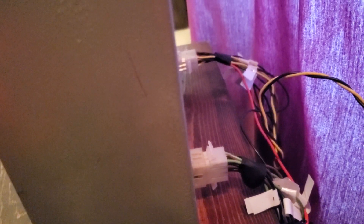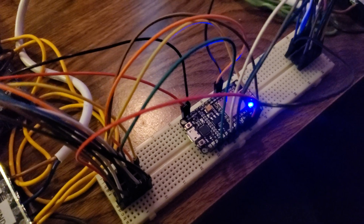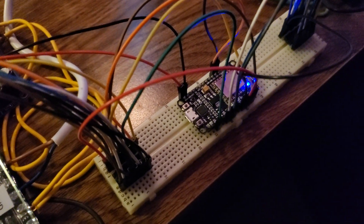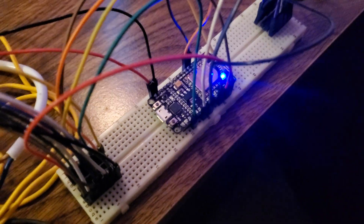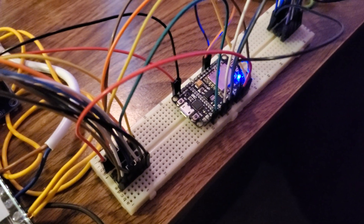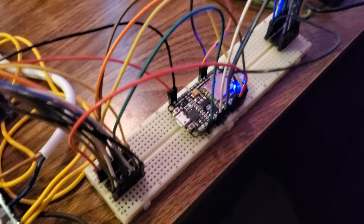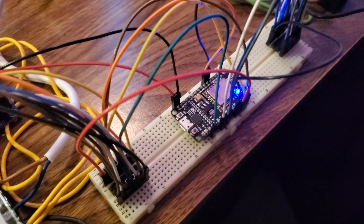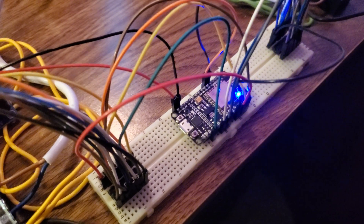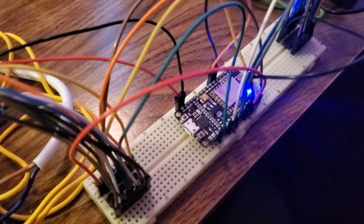These displays also have the dollar sign, but since I'm limited on my inputs I am unable to use the dollar sign in my implementation. So one of the base problems is the lack of input/output pins on these ESP8266 microcontrollers. Basically, by the time you're done ignoring the pins that can't be used — for flashing, or pins that will prevent it from booting if held low or high — you're left with only 10 usable pins.